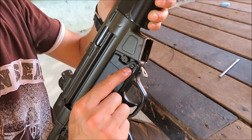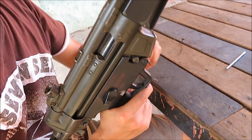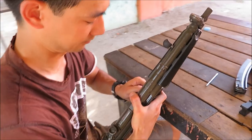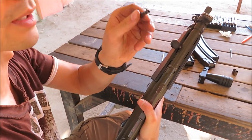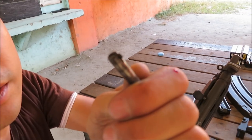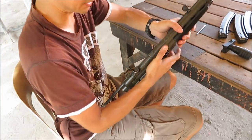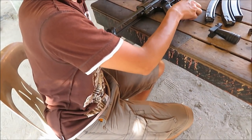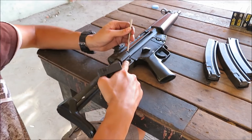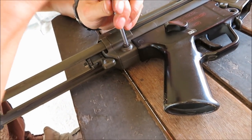It uses HK push pins — I actually mistook them for bobby pins, but just give them a push. The first one has a little captured pin or wire on the side. These have just become known as HK pins even if made by another manufacturer. The last one's a bit tight so we'll use a punch and give it a little hammer to get it started.